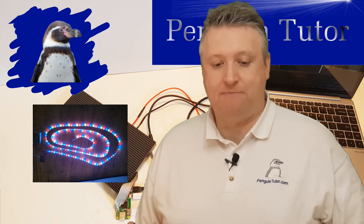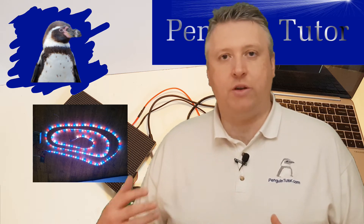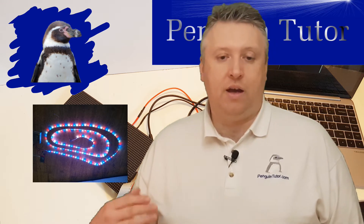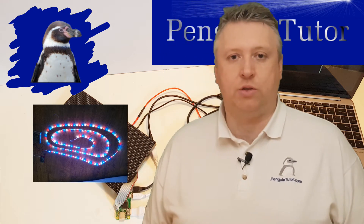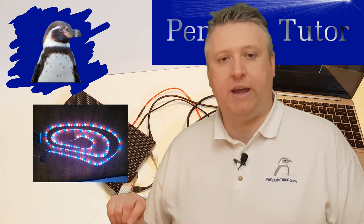Normally there would be a problem because when I've used NeoPixels in the past I've been using pulse width modulation, which conflicts with the pulse width modulation required to control the matrix display. Fortunately the library I use has been updated and now supports different kinds of ports, not just PWM. In this case I'm going to use pulse code modulation or PCM, which is available on GPIO 21 — physically the 40th pin, the very last pin of the GPIO connector on the Raspberry Pi.